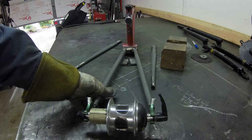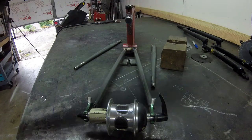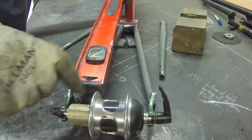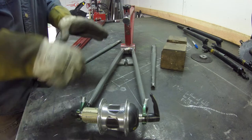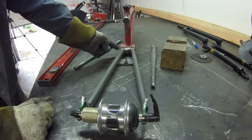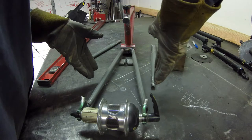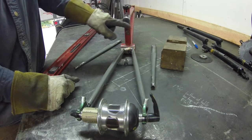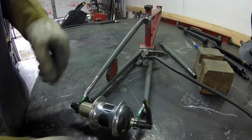First thing this morning, I decided to check the overall frame alignment. A really easy way to do that is to get yourself a straight edge like a level — place one side against the head tube, the other on the seat tube, and see where your dropout lines up. Check to the other side — should be even on both sides. First thing this morning I noticed everything was out by about a quarter of an inch. I decided I would weld one side of the chain stay and the inside of the other chain stay, in hopes that the heat would pull it into alignment. It worked — I'm stoked. I also took the time to cut off a little bit extra of the frame, welded on a flat disc, and now I've got the seat stays ready to weld into place.